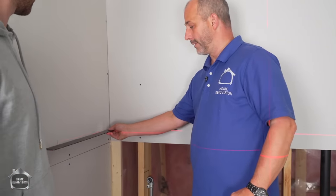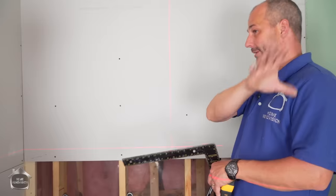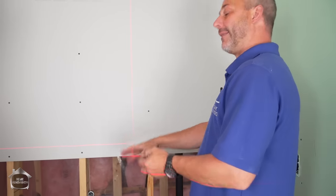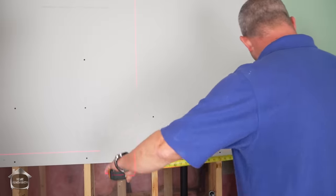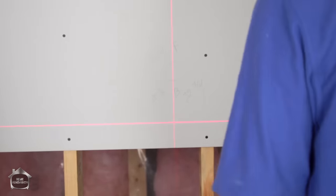There's no such thing as a square wall, right? So when you're cutting something that's already not square and doesn't have a straight edge, you've got to go from a center line. So you're going to template the cut on this wall and then translate all this information onto your wood slab. Now, the front over here, do the same thing. There's a number there, 33 and, we'll call it, 1/8. Okay?